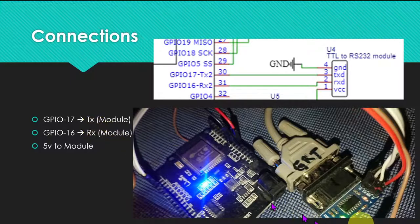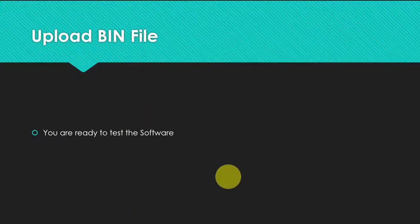For the board-to-TTL connection, you have to connect GPIO 17 to the TX pin of the module, and GPIO 16 to the RX pin of the module. This is also shown in the diagram — 16 goes to RX of the TTL module. This module is powered by 5 volts. So we are ready from a hardware angle. The next video will be about the demo software itself.